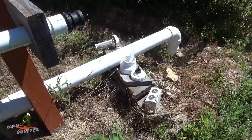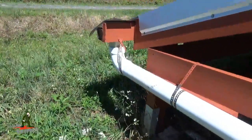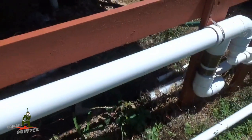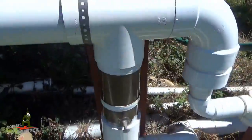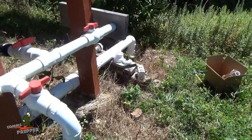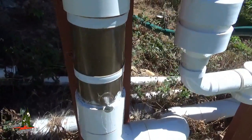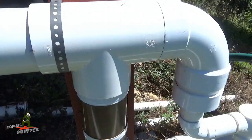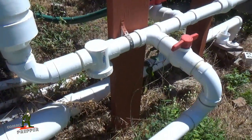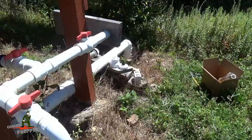For those of you who don't follow the channel, here's a quick recap of how the system works. When the rain first starts, all the dirt, pollen, and road debris falls down into the gutter, comes off the surface, down into this pipe — and that's the dirtiest water because it's the first part of the rain. It comes along here, hits this T, drops down in the T, and works its way to the back where that drip valve is. The rain puts water into that section of pipe faster than it can drip out, slowly backing up as the roof gets rinsed off. Then the pipe fills up — there's a black ball in there that floats up and plugs the hole, trapping the dirtiest water in that section of pipe and allowing the clean water to flow through down to the filter and into the tanks. Right now without the drip valve, when it rains the water is just passing through the system and dumping out on the ground.